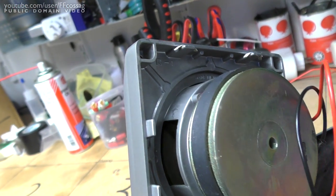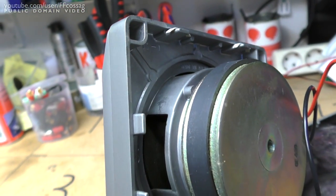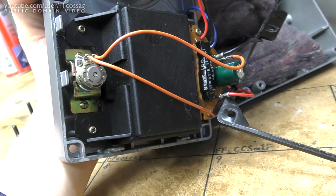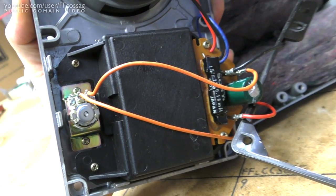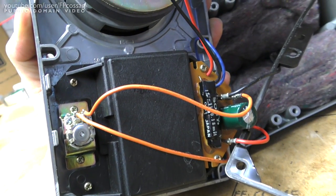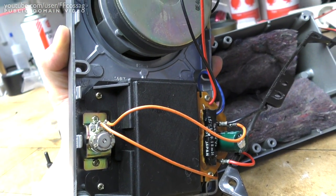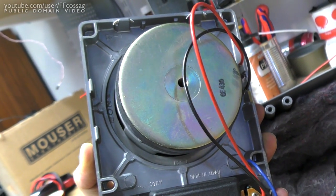Just look at that — it's a beautiful construction. Good thing I saved these from lying around. This is unique. And there's the potentiometer I want to get at — that's looking rather fancy as well. Not a bad crossover either: we've got a choke at 0.18 millihenries and a 39 microfarad cap. I think those parts are going to be fine. I cannot get over this woofer.